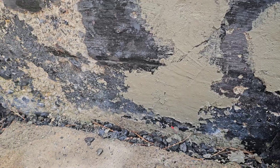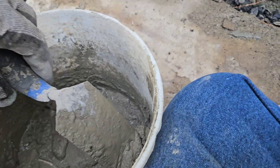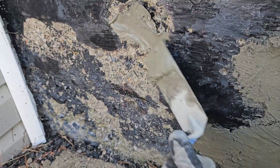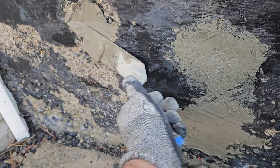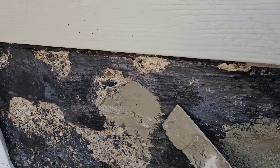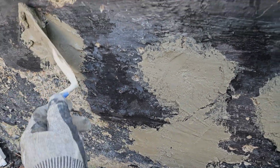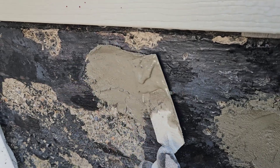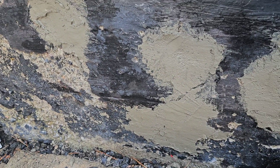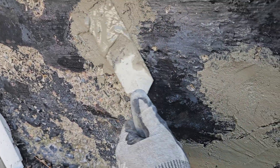Look at how fast this is going, boys and girls. I'm just using a pail, mixing up small amounts at a time. Sean's using a bigger amount, but I'm doing the smaller amounts because these are deep holes to fill — I've got one over an inch. Unless you're using a small trowel, I like this square one. I don't like the pointed trowel; this is my favorite. It could be a matter of preference, but this is the one I like and it does the job well.